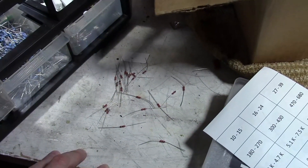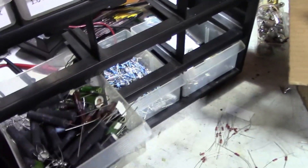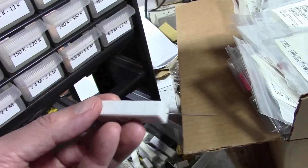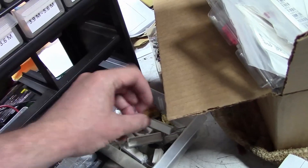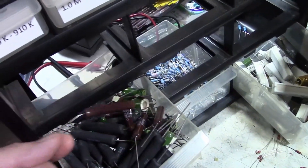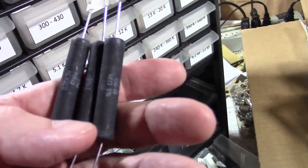Down below here I'm going to put my power resistors - they're very much unsorted right now. I've got the old ceramic sand-filled type, some metal-encased ones - aluminum housed for mounting to the chassis to dissipate the heat - some vitreous enamel ones with a nice porcelain-like coating on them, and some with a silicone coating on them. Totally unorganized right now, just thrown into drawers.